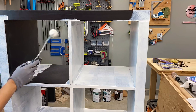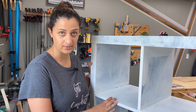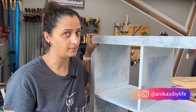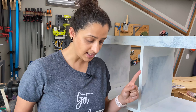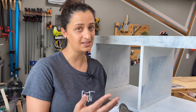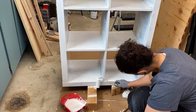The BIN primer is all dried up. It does look splotchy and needs a second coat. There are two options: another coat of the BIN primer itself, or a coat of a regular oil or water-based primer. I'm not using the BIN primer for a second coat because it's more expensive and I want to use less of it. Also, with a water-based primer I can easily use it in my paint sprayer — it's just easier and much faster to spray. I went ahead and applied another coat of primer to completely coat the shelf.